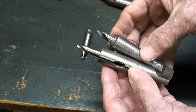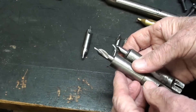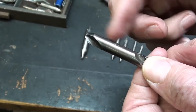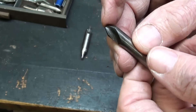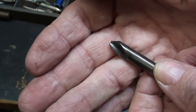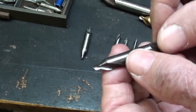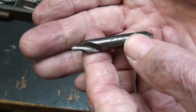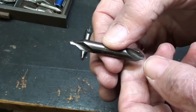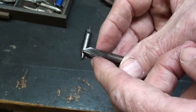I used center drills often enough that I made these Morse taper holders so I would always have them handy, one on each machine. You can't imagine what a problem it was in the school shop. This is a number four — the type I stock most often. The kids would break the tip off, but they weren't even aware they did that. When it wouldn't drill properly, they would just turn it around and run the other end into the hardened steel and ruin that end as well. I could usually hear that clear across the shop when sparks were flying and squealing was going on. Sometimes they were broken on both ends but the kids couldn't recognize that — they'd just start drilling with it.